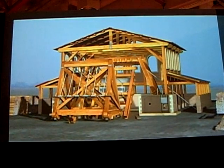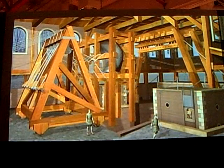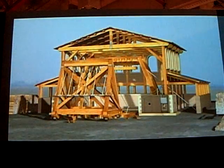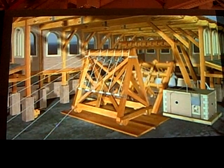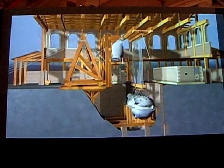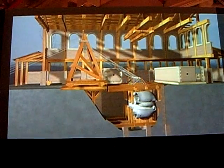The first half section is lowered into the pit by means of a machine driven by a winch. To keep the machine from capsizing as the half section is turned over, it is anchored to the ground by cables. With a hoisting bridge, the core bearing the bronze shims required for correct centering is placed inside the first half section. The mold of the body is closed by lowering the second half section into the pit.